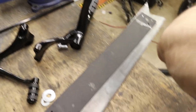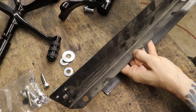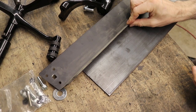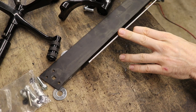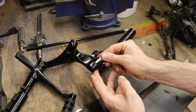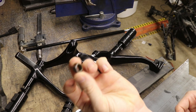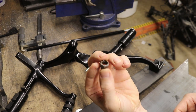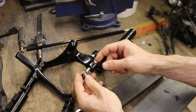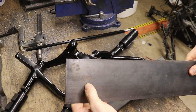To do that, I've got this metal here. I've got a piece of scrap stuff that I'm going to have to clean up and cut to fit. It's thinner gauge, maybe 18 gauge, and then this stuff is 1/8 inch thick. The front controls come with these bolts that go into mounting holes and stick out about this far. I've got some nuts from the hardware store and I've cleaned the zinc off them with vinegar. I'm going to weld these on the inside of my 1/8 inch plate.